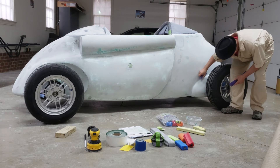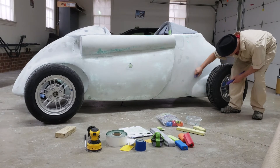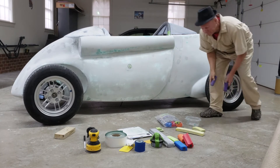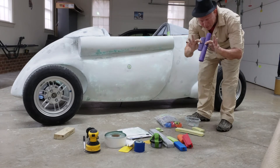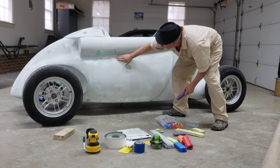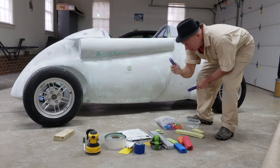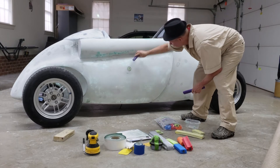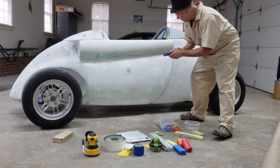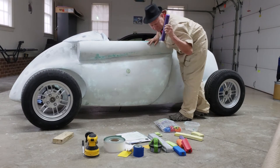If you just scrub right in the middle as you're going, you'll dig a groove before too long. So you want to use your sander in an X pattern out to transition that in — works really well. Similarly, same profile but a different length: I've got a long, straight sort of curvature here. I started out using the shorter one and found I wasn't getting a straight line — it was starting to curve. With the longer one, because it is longer, it really helps give you a nice straight line. Very helpful.